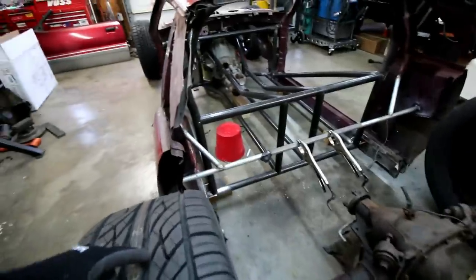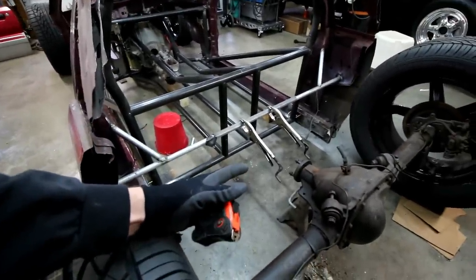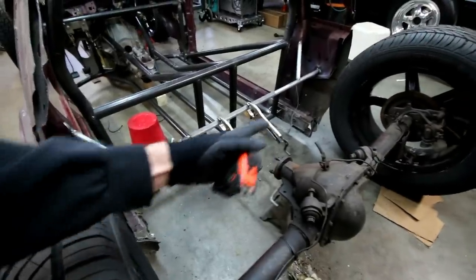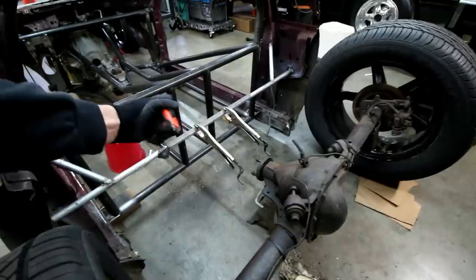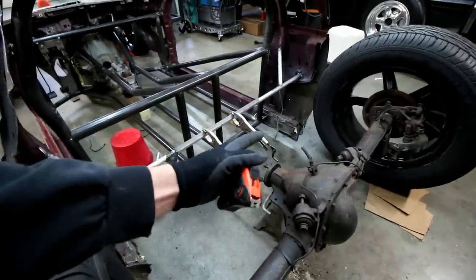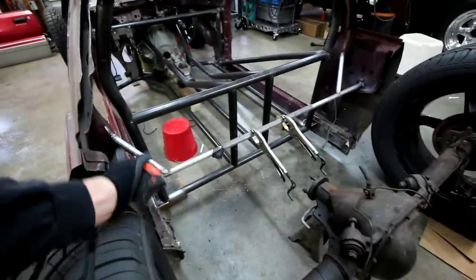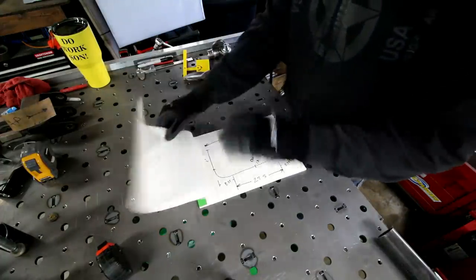And since we're measuring from the start of a 90 degree bend to the outside, we're gonna measure outside to outside. The other thing I'm gonna wanna know is how far back this thing needs to come, okay? So once it's gone through its total bend cycle, this back bar, how far back do I want this? If I want it 19 inches, 18 inches, whatever I want, I need to know the distance from there to here and from here to there. All right, so those things are pretty easy to achieve.